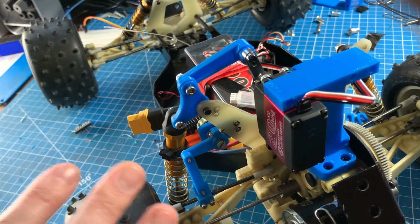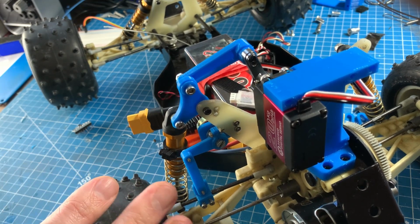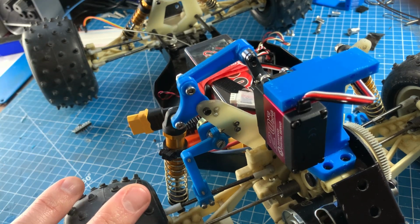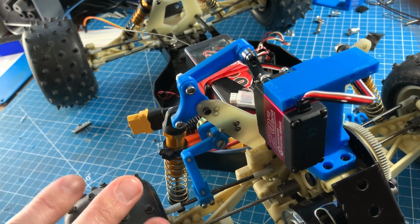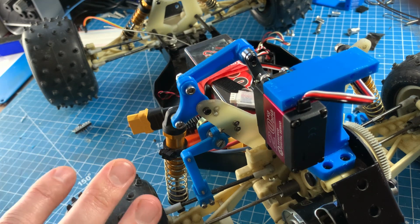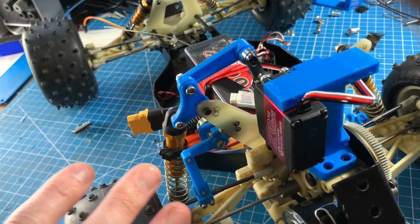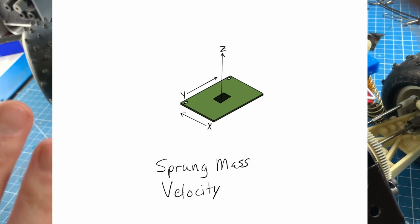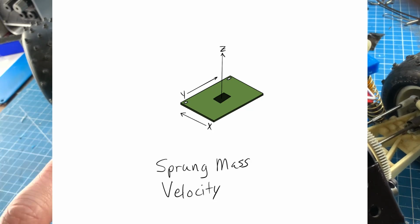Eventually I'll probably need a 4-wheel shaker rig so that I can actually see the data off of all 4 wheels at once and optimize it from there. I also need to work out the frame of reference for the accelerometer, which is affected by all 4 wheels. In the papers this was easy because the accelerometer is put directly on top of the sprung mass, which was suspended directly over the wheel. So no math was required to be worked out really.